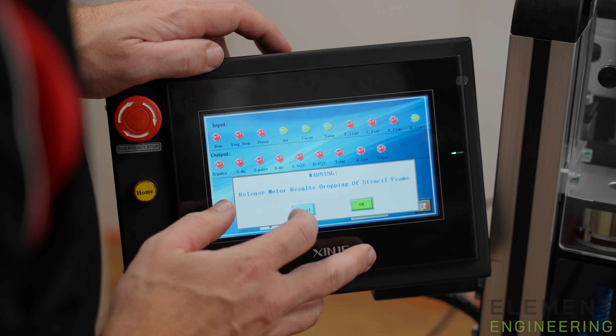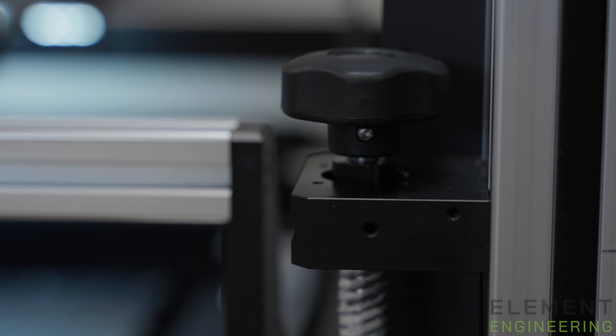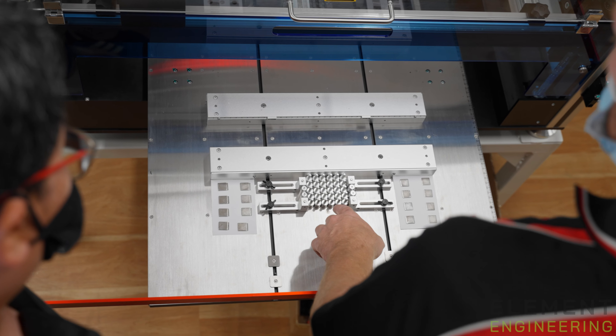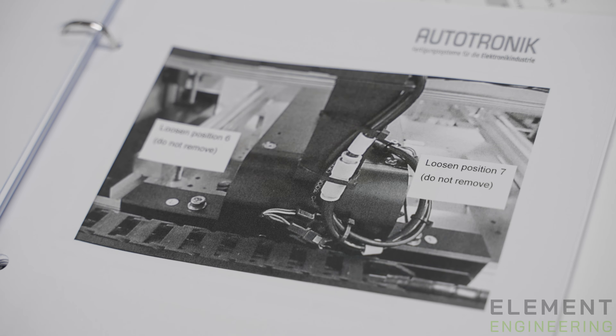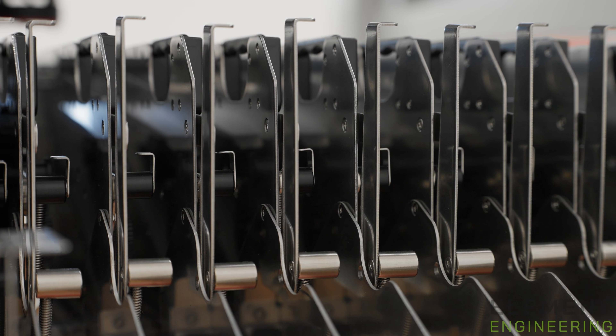We don't have it set up with a continuous conveyor line. We're basically batch-putting the circuit boards into the stencil machine, pulling them out by hand, and putting them into the pick-and-place machine. That allows us to have more feeders on the machine for the same footprint and only have one machine instead of two. It allows us to have a high mix — lots of different components on some of the more complex boards we use for our industrial IoT and consumer IoT devices. The pick-and-place machine has 128 feeders, and we have more feeders in storage, ready to set up for another job in parallel.